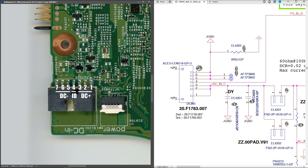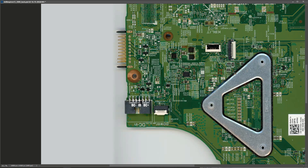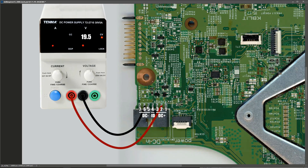We need to inject with our red wire and black wire. I checked the spec for this laptop — the Inspiron 15 3000 uses a power adapter that is 19.5 volts DC. I set the power supply to 19.5 volts, then connect my black wire to DC minus (ground) and my red wire to DC plus (positive) as identified from the schematic. When I did that it pulled a very small bit of current and then went to zero, so we certainly don't have a short.